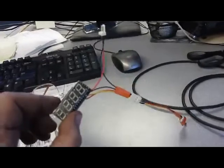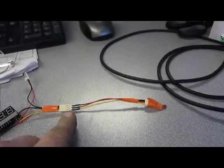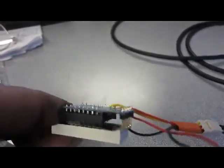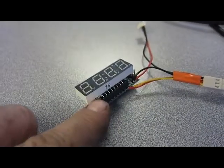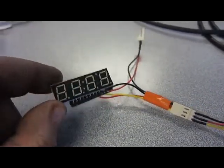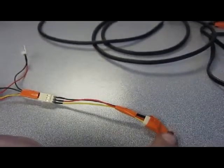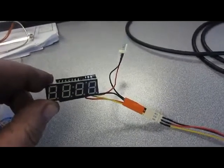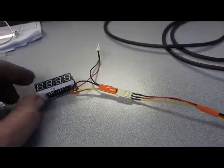Here's what you're ultimately going to create, something like this. Got the thermistor down here on the end on one of these wire connectors, plugged into another wire connector which connects up to the Arduino. This one's really similar and I'm going to send it along so you can test yours. Notice this one has a little clip that you can plug the 7-segment display into. I'm going to want you to ultimately solder those displays onto the board, but this is a good way to test the display after you've bent the pins to make sure it fits okay and also to make sure it works okay. It also gives you a chance to test your thermistor. Sometimes these thermistors are bad or they overheat when you're soldering them, and that's why I've included a couple extras. So if the reading doesn't read quite what the room temperature is, go ahead and throw that thermistor away and solder up another one. Alright, let's get started.